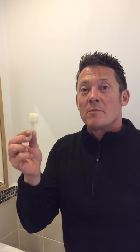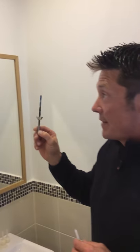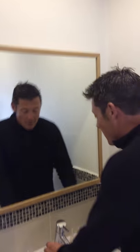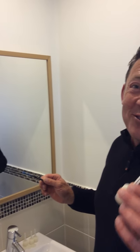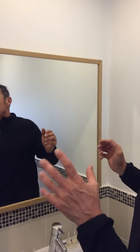Hi, my name is Andrew Blanks and today I'm going to do a test on the wall anchor fixings that we've just had the prototypes delivered for today. I'll be using the drill bit. This mirror has been poorly fixed — I fixed it but I didn't have a wall anchor at the time. It's on a dot and dab wall, and that's the point: the wall anchor is for fixing to dot and dab walls where the board can crush.